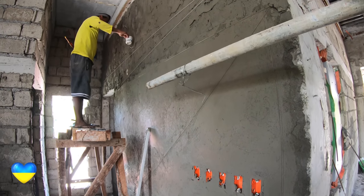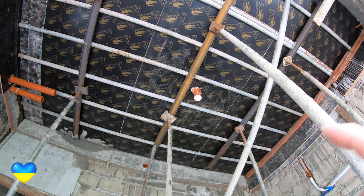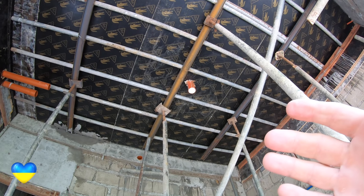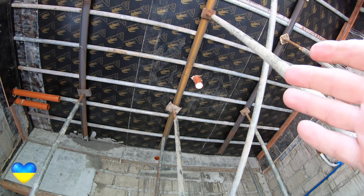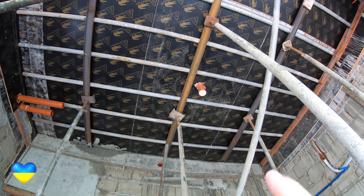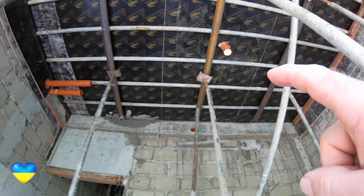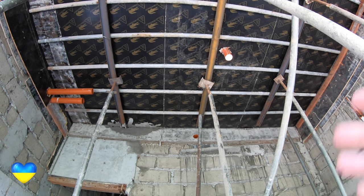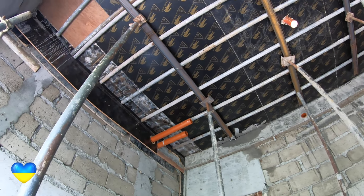The rendering has started on the inside, not just on the outside - they're working on both inside and outside. The comments I get are about the hole penetrations in the ceiling or slab for the roof. People have expressed concerns about leaking around these areas because that's going to be the most vulnerable spot for any water that doesn't go through the drain, or if the drain gets clogged and there's water sitting on top. What we're going to do later on is get with the contractor to talk about waterproofing that will prevent things like that. As long as your waterproofing is done correctly, you won't have any problem. Since the ceiling is going to be dropped down, you have exposed pipes if you ever need to do maintenance.